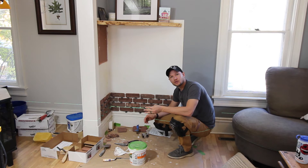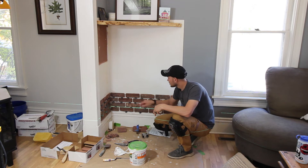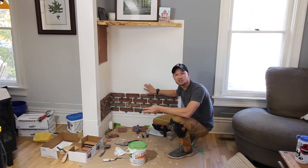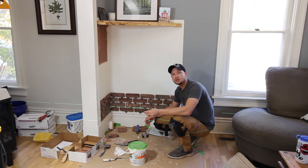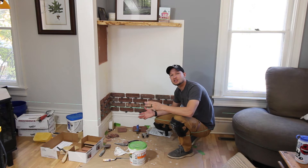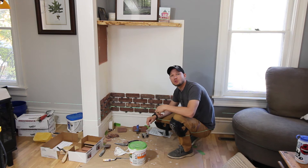We're about a quarter of the way up — four layers of bricks done. Since I don't do this every day, I wanted to take a little break. I've wiped all the excess mortar above this to make sure it doesn't dry, and now I can wash my hands and the tools. I've been working on this for about half an hour and the mortar is starting to dry on the tools. If you wash it with warm water it'll come right off while it's still setting up — once it dries it becomes a lot harder to scrape off. Washing your hands every 20 or 30 minutes is super helpful.